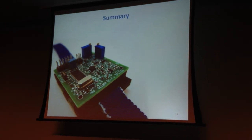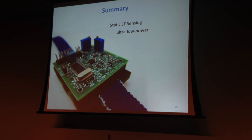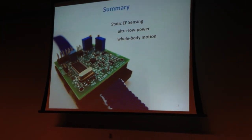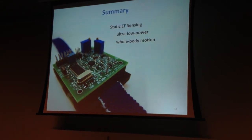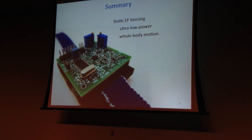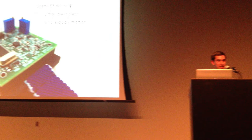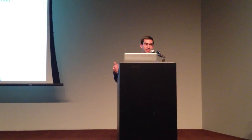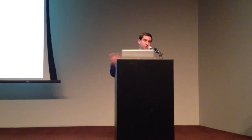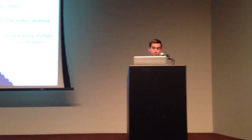Let me give a quick summary and address some limitations. I'm presenting static electric field sensing: ultra-low power, lower than an accelerometer, and able to sense parts of the body that aren't themselves instrumented. But there are major limitations. We're not actually sensing movement directly — an accelerometer truly senses acceleration on the device across three axes. All we're really sensing is changes in capacitive coupling of the body, which could be caused by environmental changes: someone running past you or an object moving closer could register as movement. It works well for low-power wake-up and simple body motion classification, but that environmental sensitivity is a real constraint.